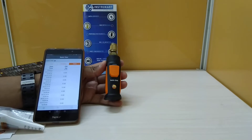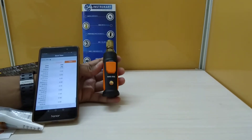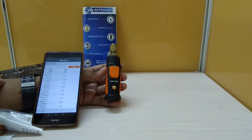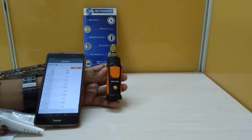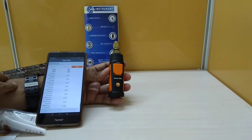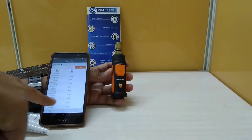This is a pressure measuring device which has a pressure range of minus 1 to plus 60 bar, which is also minus 14.7 to 870 psi. The accuracy based on the full-scale value is approximately 0.5%, and the resolution is 0.01 bar.